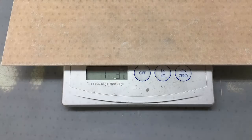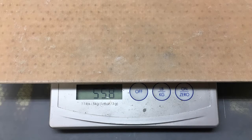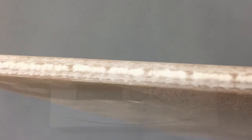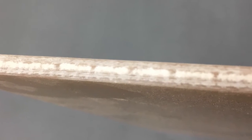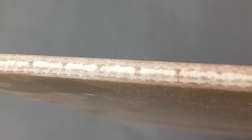On the top side, a little more uneven resin. I weighed a one-square-foot section: one pound, three and five-eighths ounces — super heavy — 558 grams. You can see the core mat inside and the rest of the laminate is thick. It's heavy, an awful lot of resin in there, but it's a quick, nice way to make a panel where weight's not a huge concern.